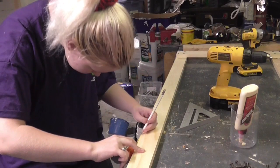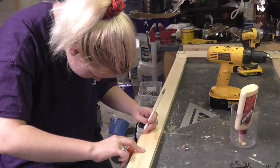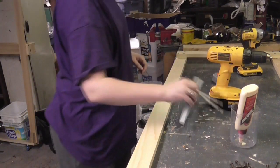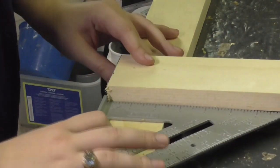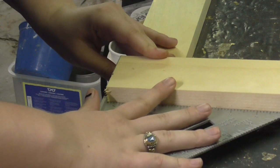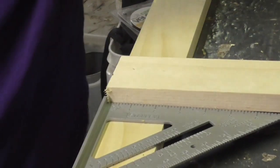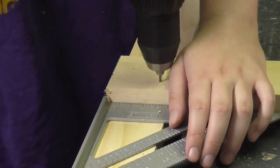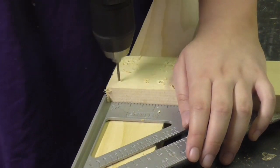Measure 38.5 inches down from the top. The mark will be along the top of the board, which will be the back of the tray. Use the squaring triangle to make sure the board is level. After securing the first side, you don't need to use the triangle for the other side. Secure the board the same way that you did at the top, with 4 screws.